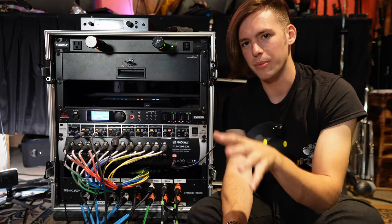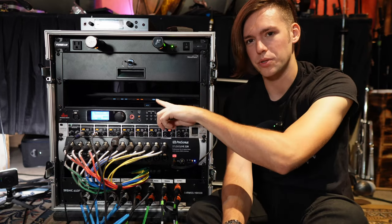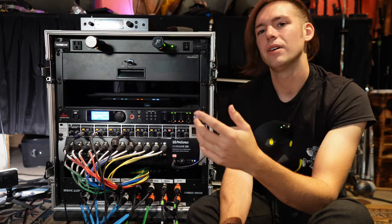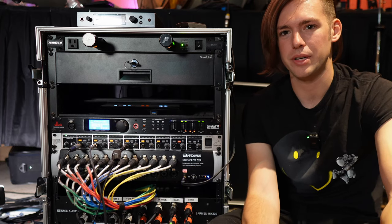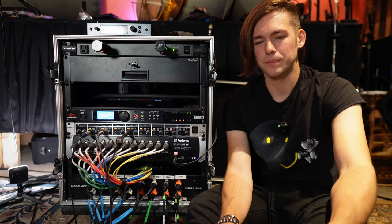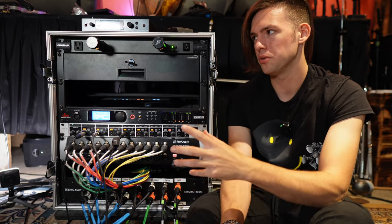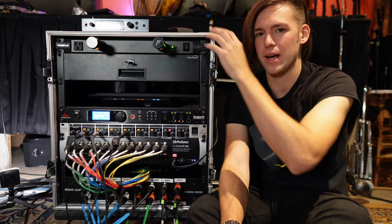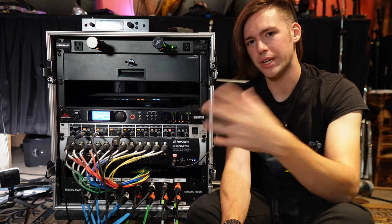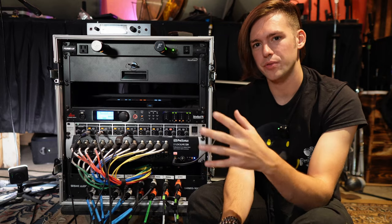The third crucial thing you need in a rack is a way to connect to it. You can either buy a separate console and run a network cable out to your mix position, or you can have a wireless router. I have a Netgear Nighthawk in here — a good dedicated router is important. There are a ton of routers out there; just get one that's well-reviewed and reliable. I've also seen some front-of-house engineers add external antennas, like a Ubiquiti antenna, on the outside of their rack to extend and strengthen the WiFi signal and reduce the chances of dropouts.